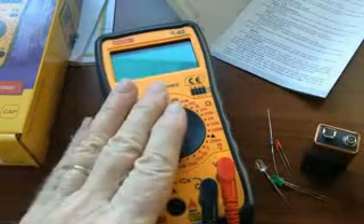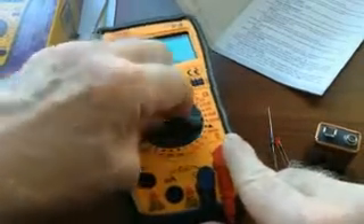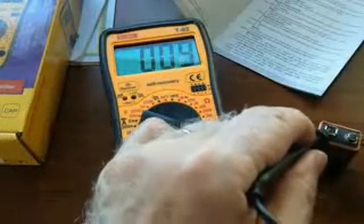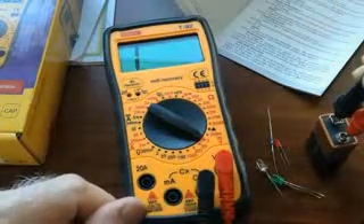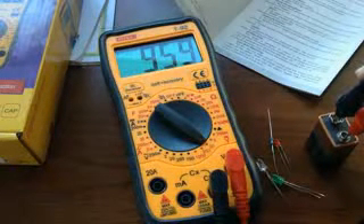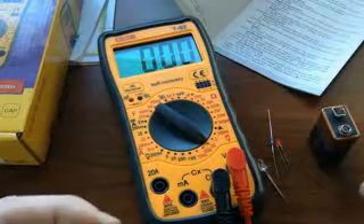Let's try some of the different functions. We've got the common plugged in — black — and red on the volt and ohm part. On 200 millivolts it just gives you a one, so we're going to overdo it with a nine-volt battery. You can see there's a one. We go up to the two-volt range — still a one. Go up to the 20-volt range and you can see that battery's got 9.59 volts on it. That worked exactly like they said. I've also tested the 120 and 240 — that works perfectly.